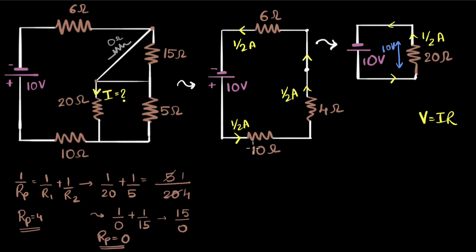The game is: if you know the current, find the voltage; if you know the voltage, find the current. So what is the voltage across each resistor? Using V equals IR: for the 10 ohm resistor, it's half times ten — five volts. For the 4 ohm resistor, it's half times four — two volts. And for the 6 ohm resistor, it's half times six — three volts. Let's check: three plus two plus five equals ten, which is exactly the 10 volt supply. Voltage and current found everywhere.